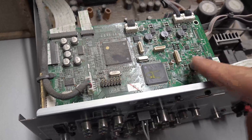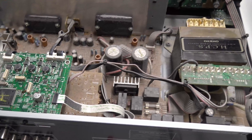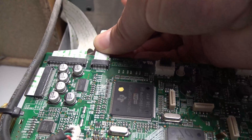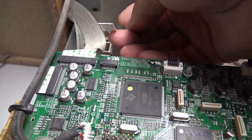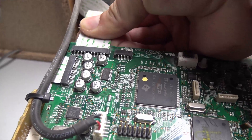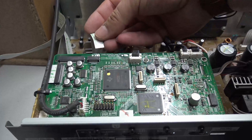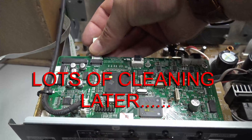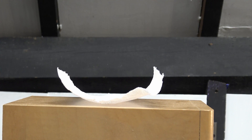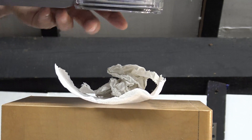You can tell this is the cleaned PCB and this is the mucky PCB. What we're going to have to do is go through and reseat all of the connectors once we've cleaned it up. With these little Sumitomo ribbon cables you can very carefully pull them and they'll pop out of their sockets. Once everything's nicely cleaned up you just slide them carefully back into their tiny connectors. Quite a bit of crap came out of that.